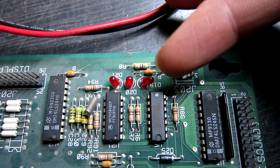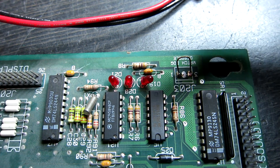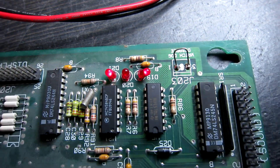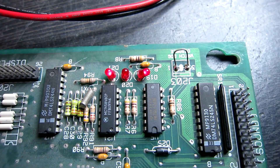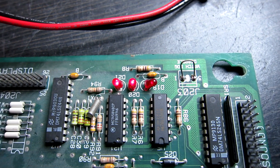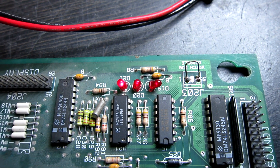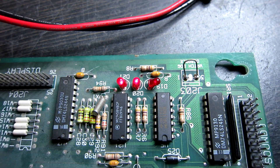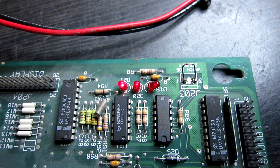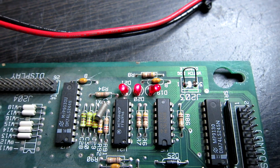I've added a watchdog disabled jumper as the reset line was pulsing, and now the status LED and blanking LED are both flashing. So it's running a bit, but there's clearly a fault somewhere — possibly on the address bus — that's causing it to not quite operate correctly, so let's proceed to test further.